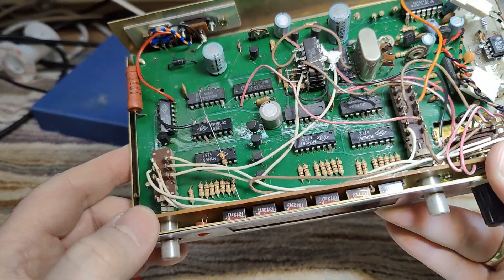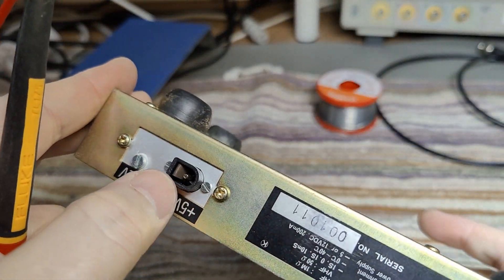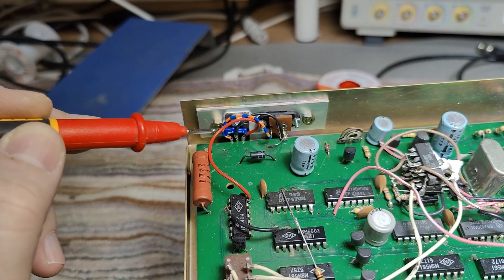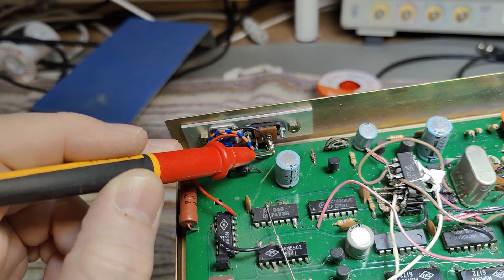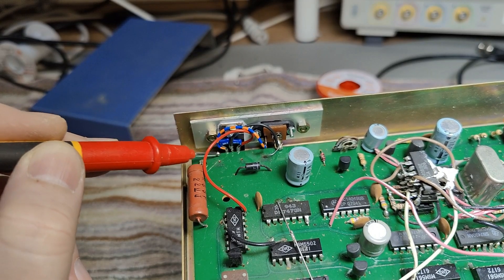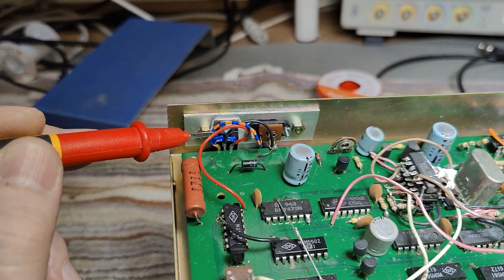I was afraid of the input connector here. My assumption is definitely correct. The center pin is the black wire that goes to the center pin of the regulator, so that center pin is definitely the negative. The outer ring of your DC connector is your input. No reverse diode, no fuse, no protection whatsoever. First time somebody does this wrong, they're going to blow up something. There's a diode here, but it's not connected to anything.